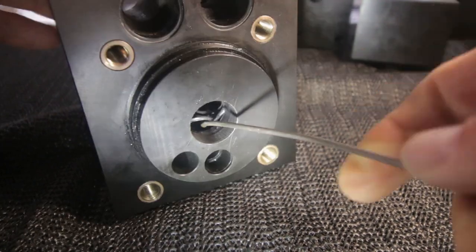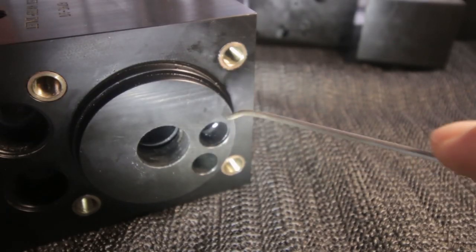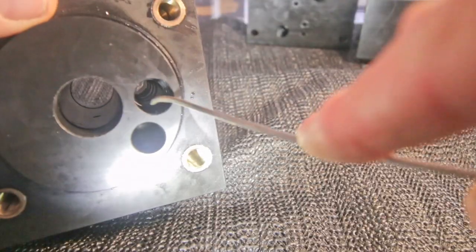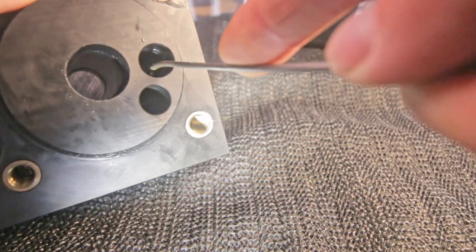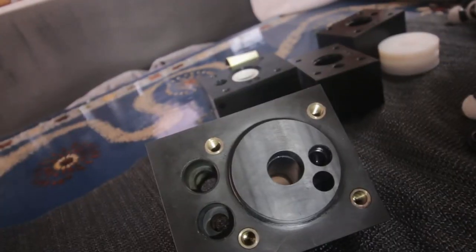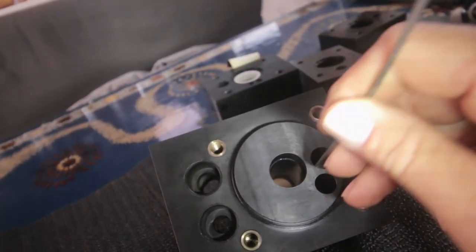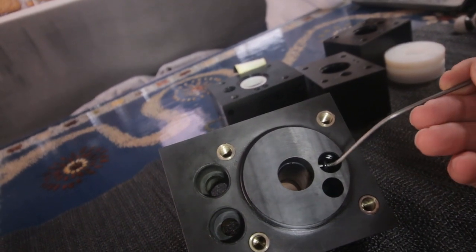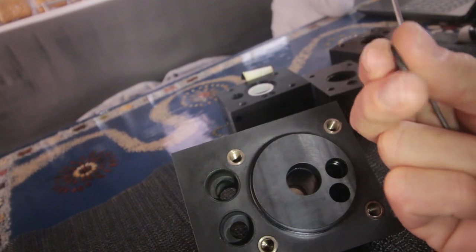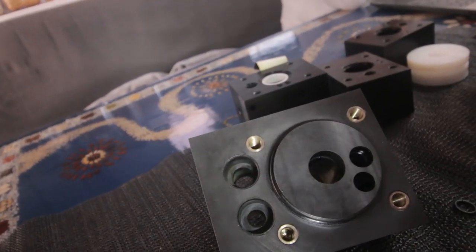Come on. This is actually the same. You can't see those well. You need to slide your dentist pick towards the seal and then try to get it underneath. I couldn't really show you this one. Look what happens to my homemade dentist pick. But I have one out already. They're hard to get out. They're quite stiff, hard rings. So only three to go.